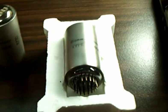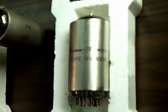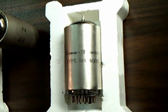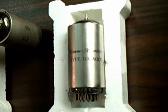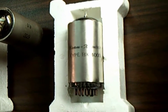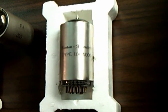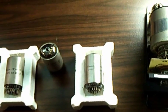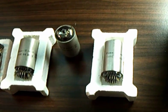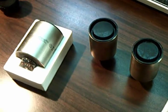Right here this one also looks just like the BX2012 or the BX2005, but it is not. It is a Burroughs BX4000 — that is one of the rarest types of beam switching tube, like the BX2012. It is a low voltage variant with a much lower operating voltage than most other beam switching tubes. Most beam switching tubes are designed to operate directly in conjunction with the Nixie tube — you hook the beam switching tube directly to the Nixie tube with almost no intermediate circuitry and it drives it. That's one of the major advantages of beam switching tubes over Decatrons.